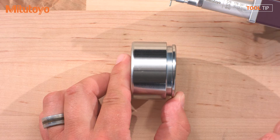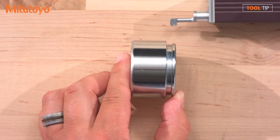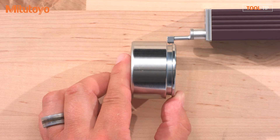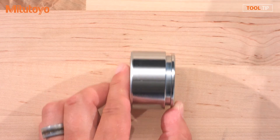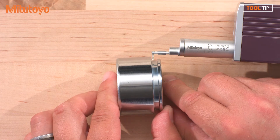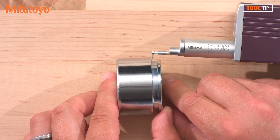Are there any other features that would lend themselves to a skidless device versus a skidded? Absolutely. Let's switch parts and take a look at a piston. Notice the piston has a small groove here on the outside diameter. If we wanted to measure this groove, it would be difficult with a skidded system because the skid is larger than the groove that needs to be measured, so I could not actually measure the bottom surface of this groove with a skidded unit. However, if I bring my skidless system in, I can easily not only reach the groove, but I still have room to measure from side to side along that groove.